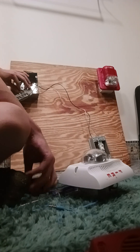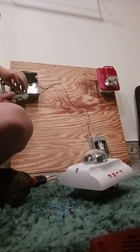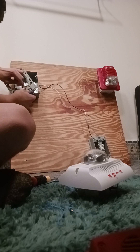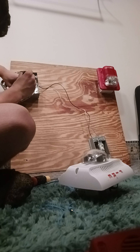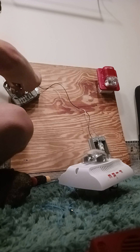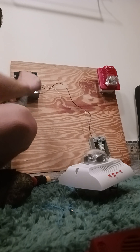You basically need to reuse the screw and screw the terminals with your screwdriver, then just tighten them on. Place the wire here — once again, just replace the wire, a little bit more — and now screw in the wire. There, now your wire is in.